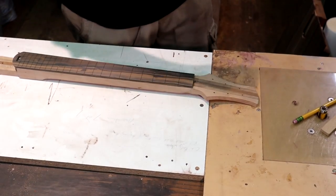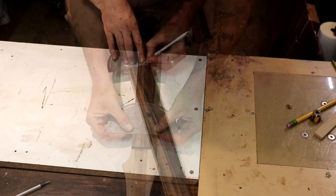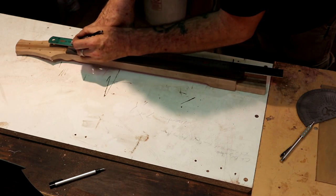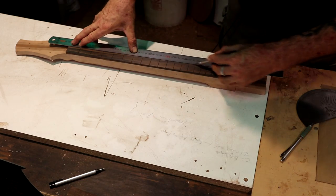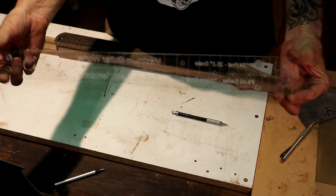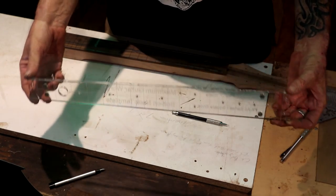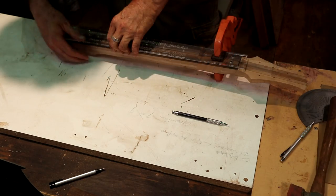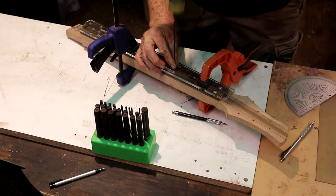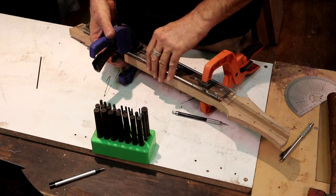To mark out the center line I'll use my Crimson protractor — I swear this has become the most used tool in the shop. The fact that it's in millimeters makes it a superior measuring system for guitar work. I'll use a 0.5 millimeter pencil for this line. Center line done. Here is my Maximum Guitar Works 25 inch scale, square end, 24 fret fretboard template — I'm just using this for markup. I'll line it up on the center line and use my center punch to mark all the fret marker locations.